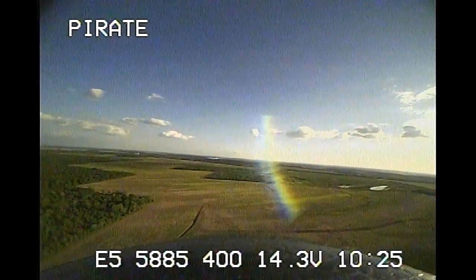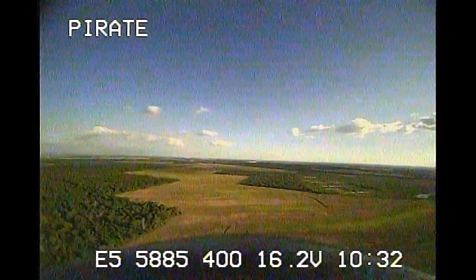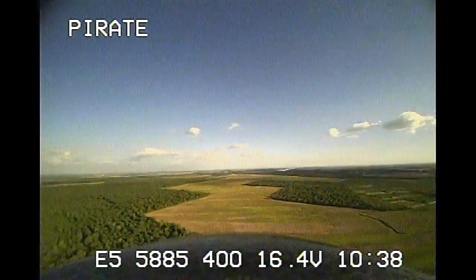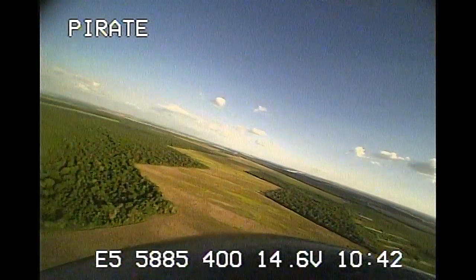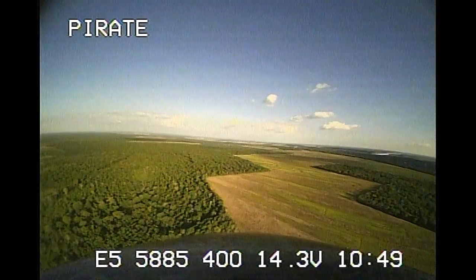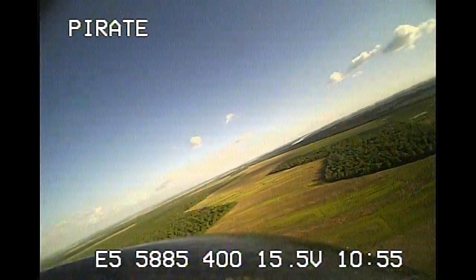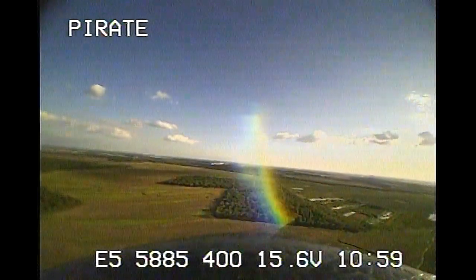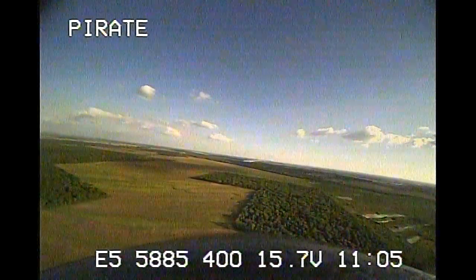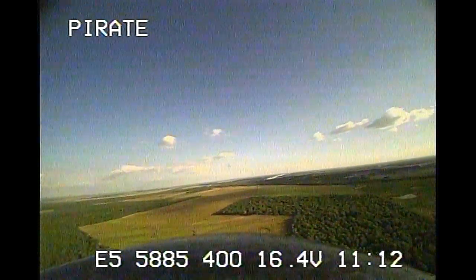I was quite impressed with the low-light performance of the camera, as well as in full sunny sunlight conditions. I noticed my video was getting a little bit weak here — maybe it just switched antennas. We're almost a mile out. That corner of the woods off the nose right there is approximately one mile out from home. I'm looking at my RSSI on my transmitter — I'm using the R9 module and R9 MM receiver in the airplane with the Jumper T16 transmitter. Right now I have 70% RSSI.